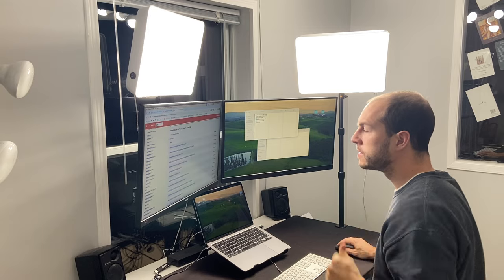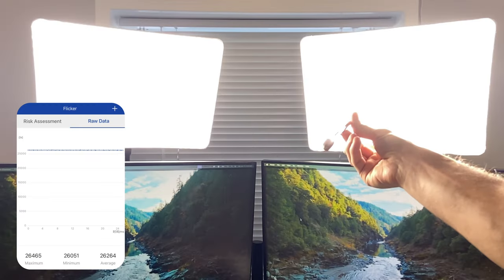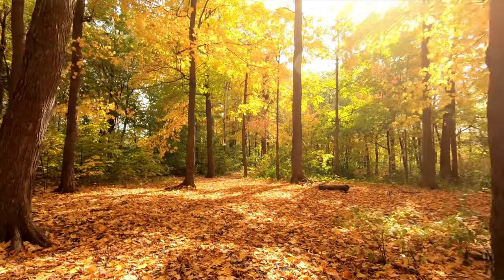I really like high quality light — I think it's an extremely important aspect to be exposed to a lot of bright light especially in the morning. These lamps are basically just an aluminum cake pan with LED strips on the inside and a diffuser over the top. They're very bright but comfortable because they're large lights, offering a full spectrum light source with no weird dips or spikes, very high color rendering, and they're flicker free because of the DC power supply. My favorite feature is that they can be mounted above your monitors, freeing up desk space. Light from above is also more effective — the cells in our eyes are most sensitive to circadian light on the lower half of our retina.